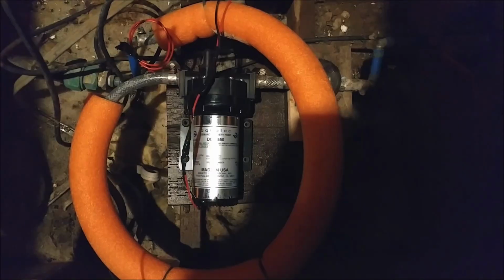It also led to a loud rattle and a water hammer between the toilet and the hose bib. And it would just be boom, boom, boom, boom. As soon as this water came in from the cistern pump, it would go out to those two lines and then come in to the pressure tank. The pressure tank is backfeeding these two lines and trying to pressurize the whole house. And so you get this boom, boom, boom, and it was doing that for 7 years. I tried to figure out how to fix it. I think I did a video where I made a flexible line to try and eliminate that. It helped take the sound down a little bit, but it didn't fix the problem. And so you just have this battling going on.